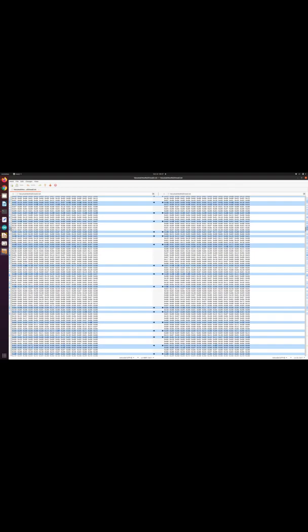However, the problem is that most of that PROM appears to have been corrupted. The entry point for the Philips microcontroller is at address zero, and the very first instruction is number two, which represents a return instruction — and that's not something you can start a program with, so it's pretty clear it's corrupted. I've dumped the program multiple times and compared the dumps using the file comparison utility meld, and many of the data addresses that come back don't match — even forcing 20, 30, or 50 rereads and taking the most common return values, they still don't match. The program in this ROM is severely corrupted.